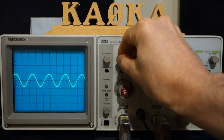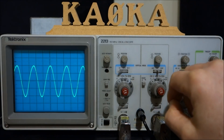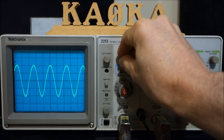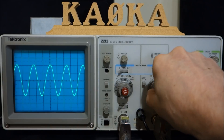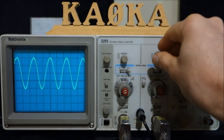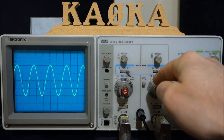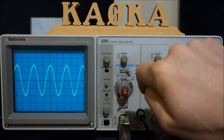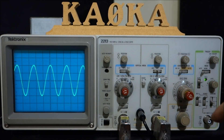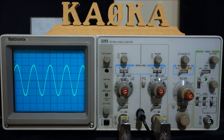We'll move this to the center and get a little more voltage — going to two volts without moving the calibration. We're getting about plus or minus two divisions on channel one, and channel two is also plus and minus two divisions. Perfect — both channels confirmed equal. Now we can go ahead and move the scope probes so that one is on each side of the balanced transmission line. The vertical mode has been set to both.